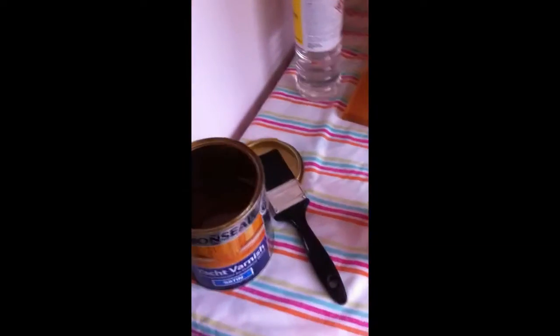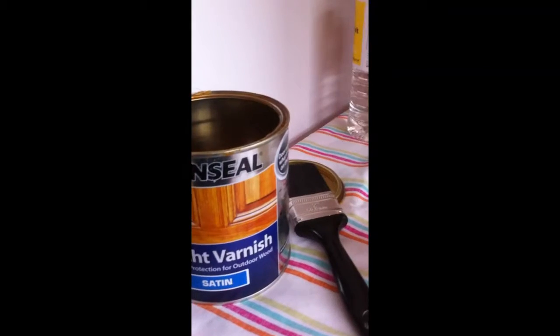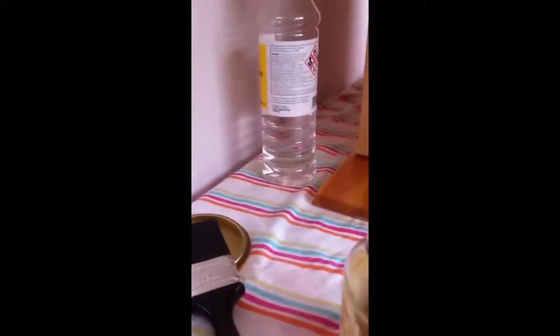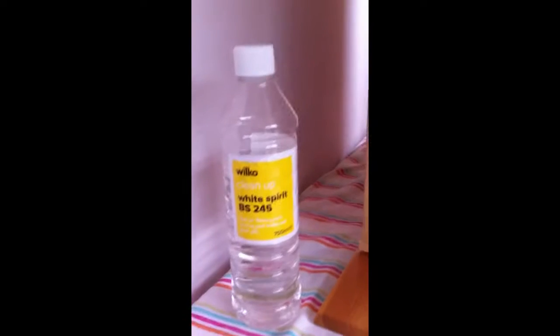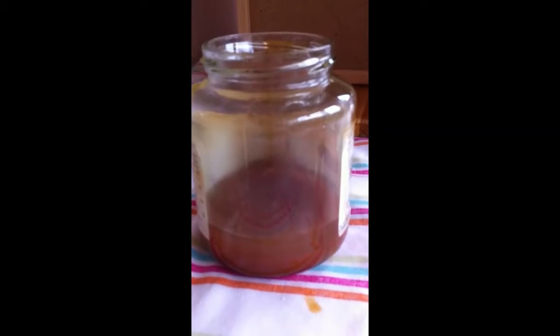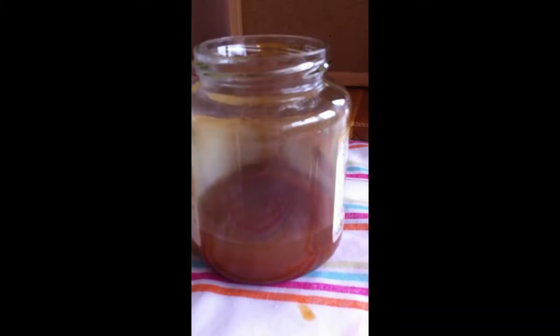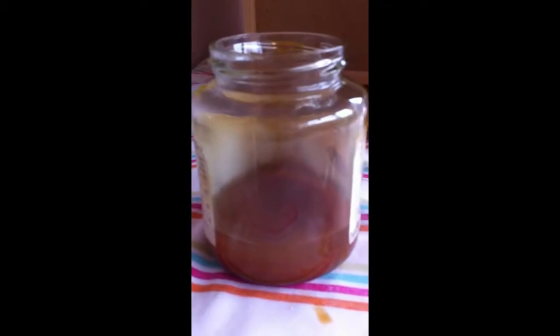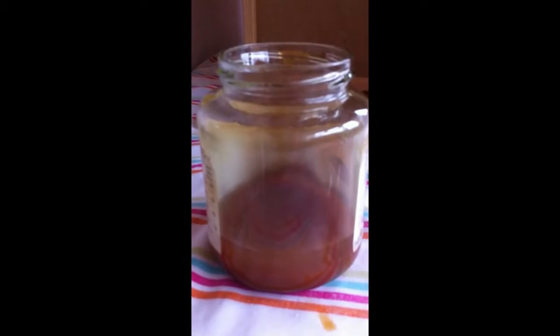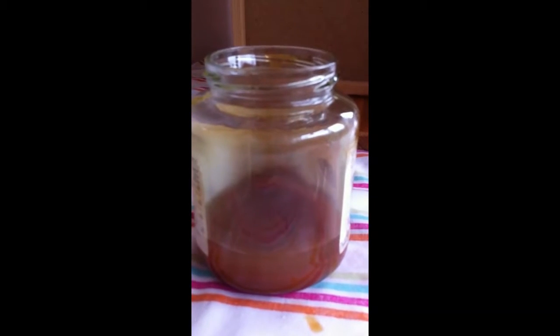So I've tried a little inconspicuous bit of the wood with varnish straight from the tin — I'm using yacht varnish again — and it seems to be absorbing it very quickly. So what I've done, I've got white spirit and poured some of the yacht varnish into a jar and then diluted it with white spirit. This will be the first coat now, rather than using pure yacht varnish — just diluted it a bit. Hopefully it's likely to seal it, and then the next coat of varnish will go on better.